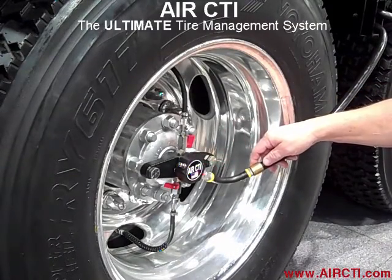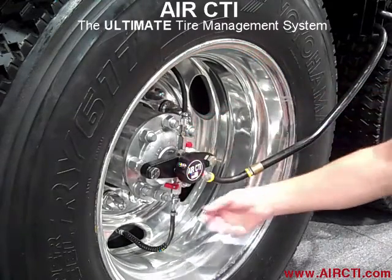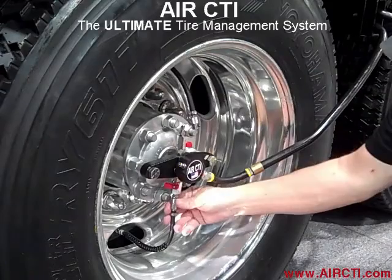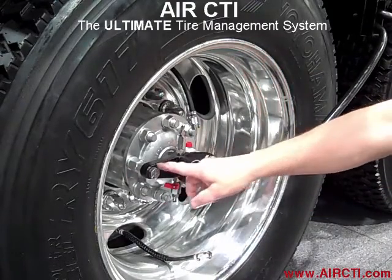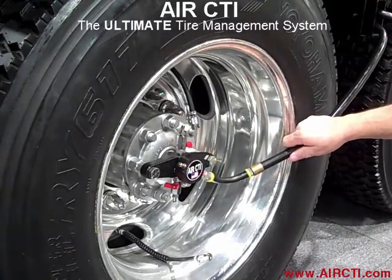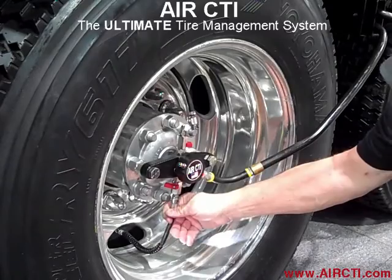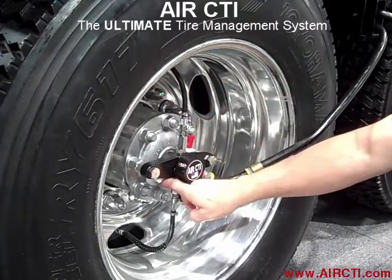It's a very simple process to change the wheel on this system. We have shut-off valves right here for each tire — the inside and the outside tire — and we have disconnect fittings to disconnect if you want to change the tire. Disconnect these two hoses, take out this bolt and this bolt, and the whole rotating assembly swings up and out. When we want to put it back on, put the bolts in the holes, tighten them down, connect the quick disconnects, turn on the valves, and you're ready to go back to work.